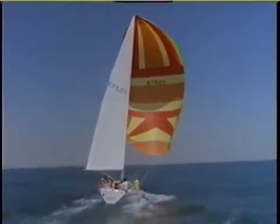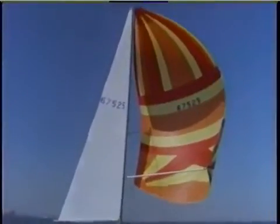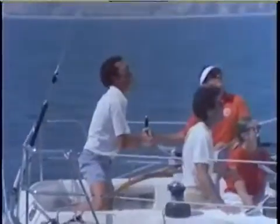In calling pole position relative to the wind, use the attitude of the spinnaker as shown by the center seam or the luff and by the windex at the masthead. The luff should rise vertically from the end of the pole. If the luff or the center seam, whichever is easiest to see, slopes to windward, you should bring the pole aft and square it to the wind. If the luff slopes to leeward, as it does here, then ease the pole forward and ease the sheet to straighten up the chute.